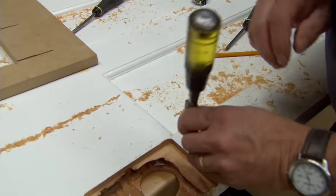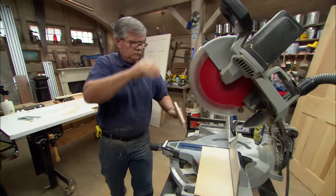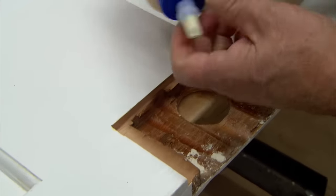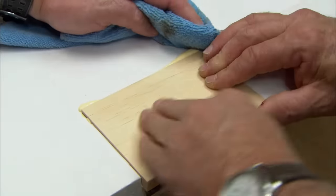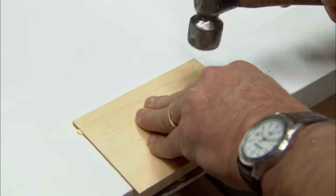Now I want to square up the corners. Then I'll mark the length of my Dutchman and cut it on my saw. Now I'm going to glue it. Here's where we can see why you over-cut the length — we've actually got some meat to glue in. If I had cut it too short, I'd have nothing to patch it to. So now I'm going to take my piece and push it right into the wet glue, and get it to ooze right out of there.